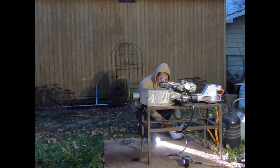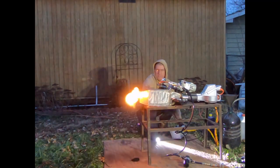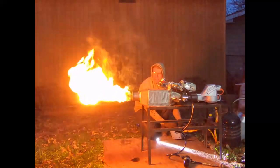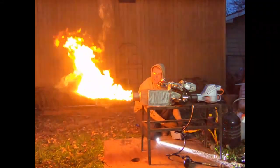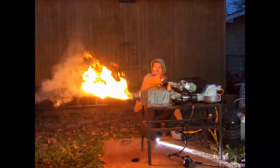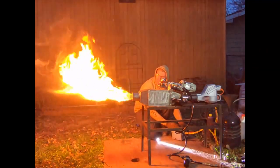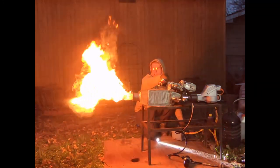Here's the ignition process — the first time I've ever lit this thing. It's extremely cold outside, and events like this make me question whether it's practical to do ignition on waste oil. It might be better to start with some diesel or waste oil with a strong cut of diesel just for ignition. You can see we're getting a needle jet of fluid flying out — that tells us we are not atomizing the fuel. There's still a central core column of fuel spraying out in the form of a rod, so that tells me it's too cold.